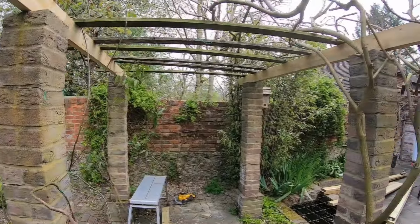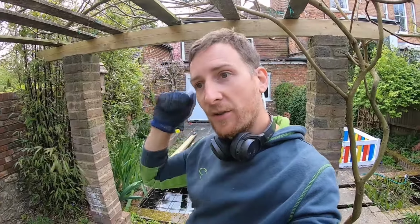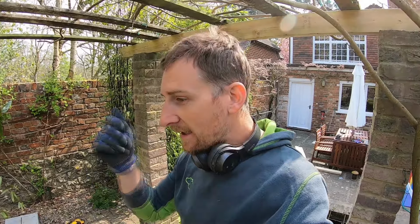So as you saw from the work so far, what I've done is I had to put timber up and then take off all of these above timbers, put them onto the one that I put up there specially, took that one off, and so forth, backwards and forwards, and then marked out where the rebars, which are set up in the top, and then marked them, brought them back down. So those timbers have been up there three times at least each, in alternating support.